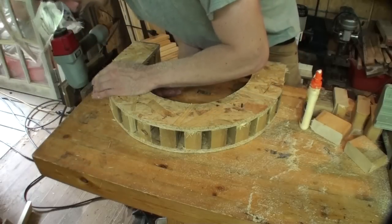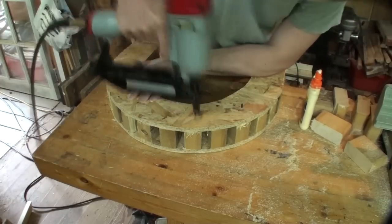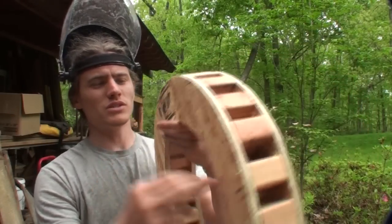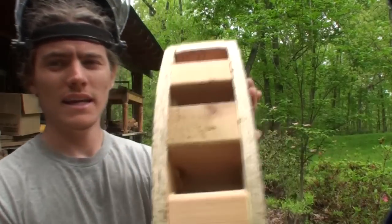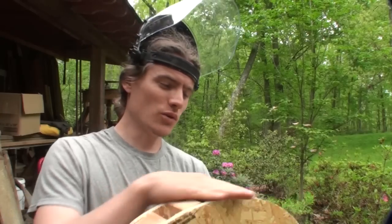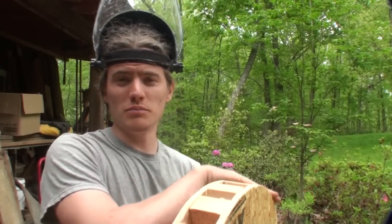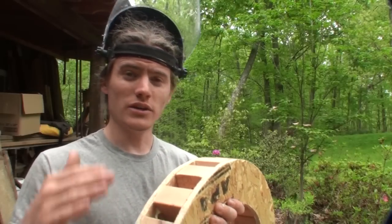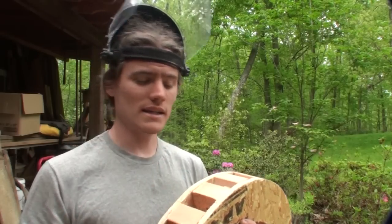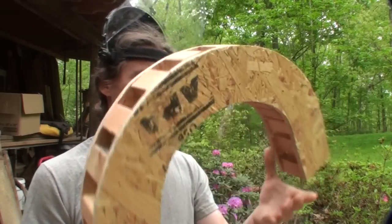You could put a piece of plywood around the outside of that too to make a more even surface. The completed form is very simple — all it consisted of was two pieces of OSB cut to the arch and then filled in with those 2x4 spacers. That'll give plenty of support for this bent lamination. If you wanted to make this surface even smoother, you could bend a piece of thin plywood around it. You can also laminate a form out of a bunch of pieces of plywood to get a totally solid form. For my case, I'm doing these two bends and then these things are no good to me.